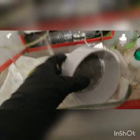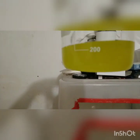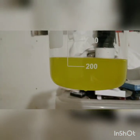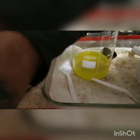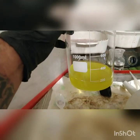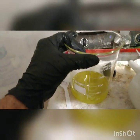So the filter has silica, bits of ash, and our solution is a yellow to yellowish-green color. I could have probably used a better filter than the Whatman. The solution is cloudy — I'm sure there are chlorides in there since I used tap water. In a hurry with this video, but it doesn't matter — this is a first drop, all part of just the recovery. I will drop this gold and take the powder and refine it.